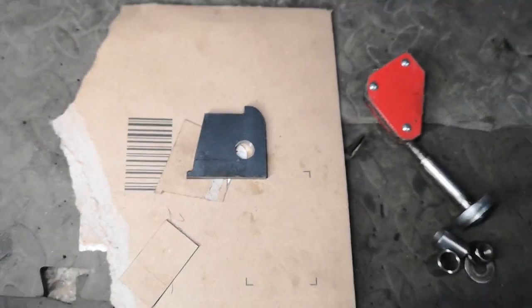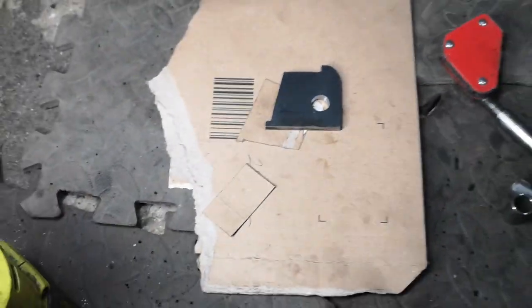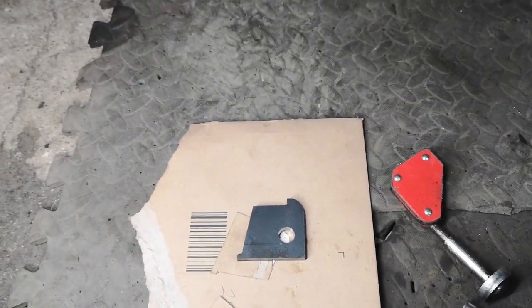Could do with a mill, I've got to admit — 12.49 millimeter hole. It was a bit tricky to do with a Dremel evenly, but we've done a happy job. So I'm going to make two more of those now for the other side, and then we can weld them all up.